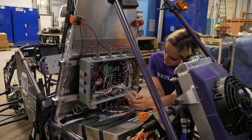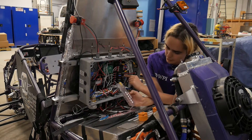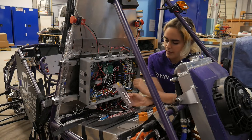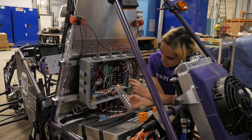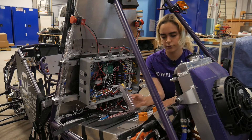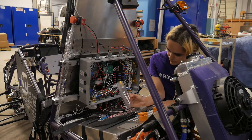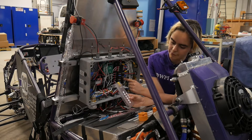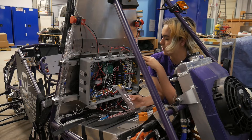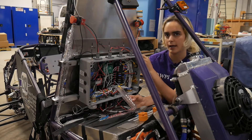Going down the right side, we have the LEDs, which currently don't have a fuse in them, and these come out to our underglow. Then the accumulator, which comes out here and powers all of our general accumulator GLV stuff off this fuse. Then on the last one we have the front box, which controls everything on the front of the car — the dashboard, front I/O, and speakers.